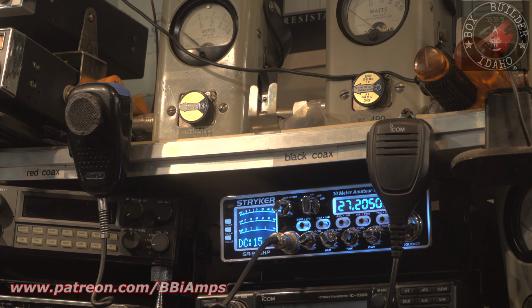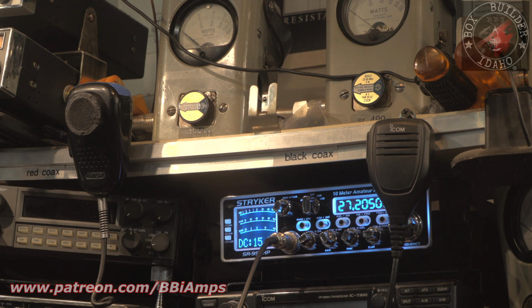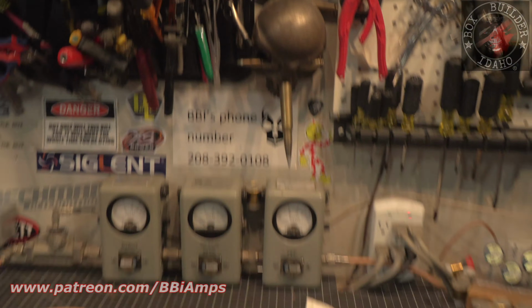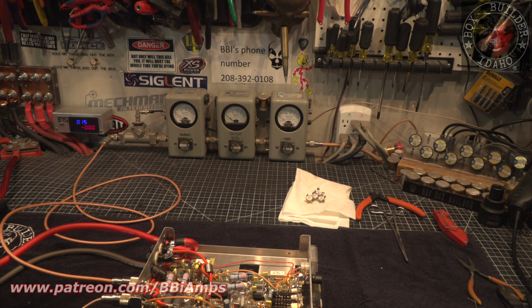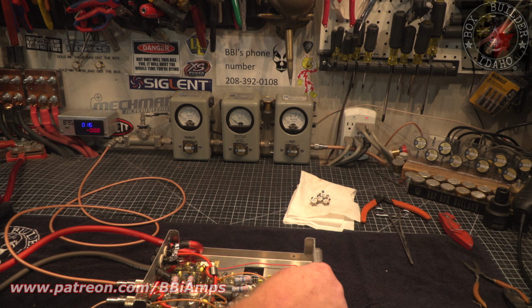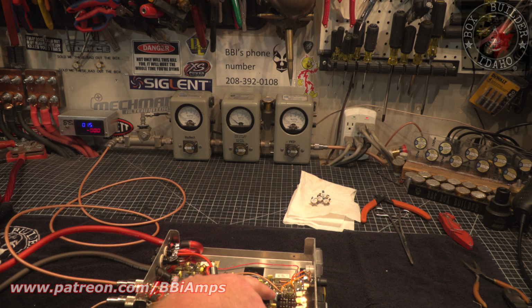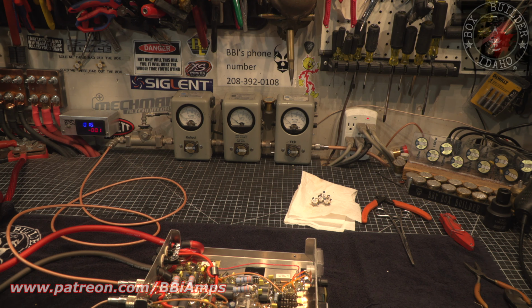Like I said, we're just a hair overdriving this thing. But the amplifier is capable of that. Now, what you never, ever, ever want to do is push the dial-a-watt button in and use the dial-a-watt, because it brings this little tiny resistor here.